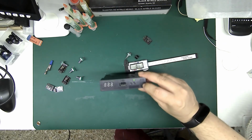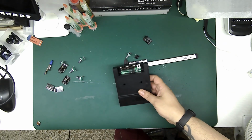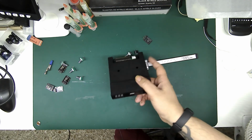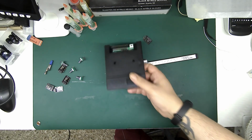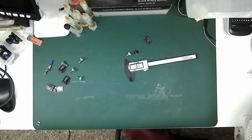I'm going to put the rotary encoder here next to the buttons. I'm thinking about putting the piezoelectric somewhere like here, or maybe here. Well, let's see how it goes. So now let's measure them, and the next step will be to open them and solder the headers on the PCB so I can connect all the hardware mods, as well as the headers needed for flashing the firmware.